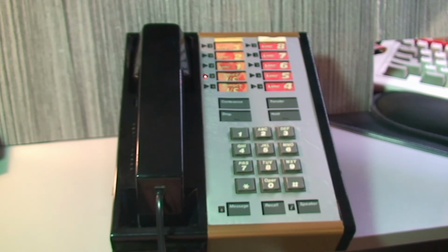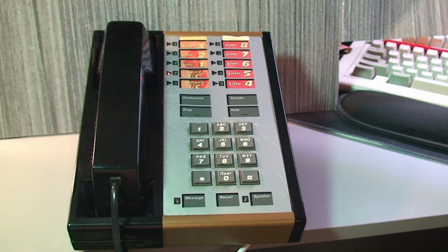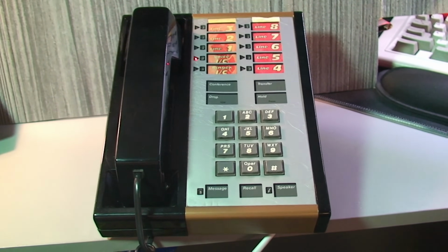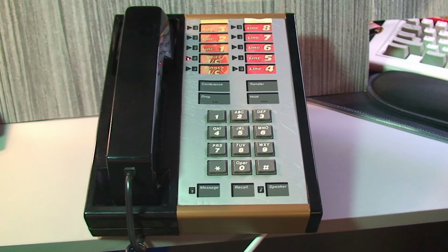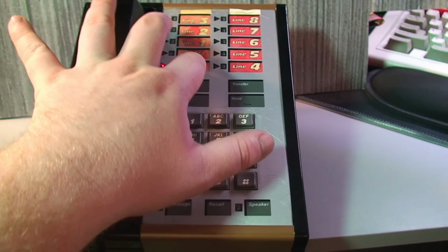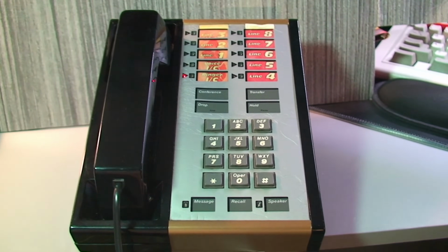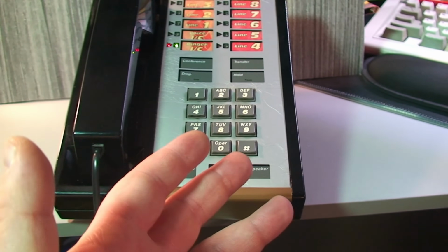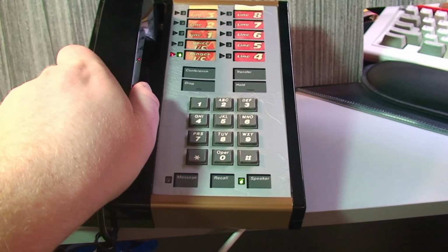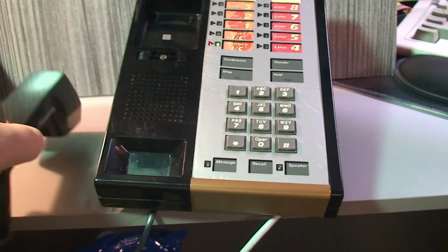And if I set that switch to the middle position, we're now in the normal operating mode. And so now let's say you're sitting at your desk and you need to call Beth or Susie. What you'd end up doing is going down here and pressing either of these 2 intercom lines, and then you'd go ahead. You can put it on speaker, but again, you can't talk to them unless you take the actual receiver off the hook and talk into its microphone.